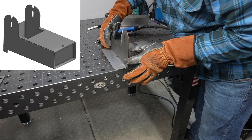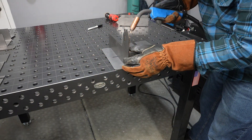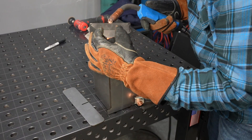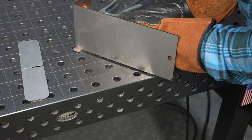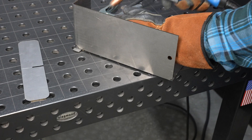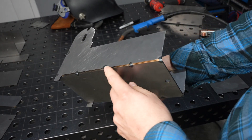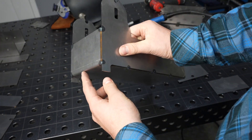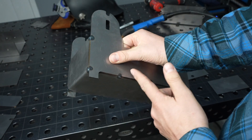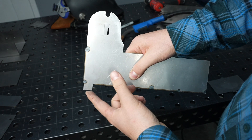Now I can start to piece together the main inlet tube and firebox. I'm just using a different piece to act as a shim so I have my whole joint open to weld up. I didn't use any tab and slot — I didn't really need it. You saw how easily I could tack that up, and this bend right there just squares everything up without having to use any tooling, which is pretty nice whenever you can do that.